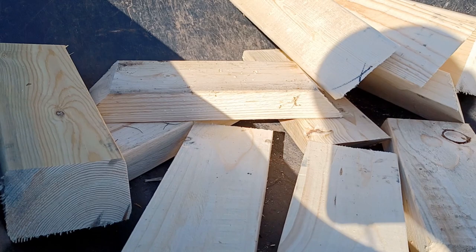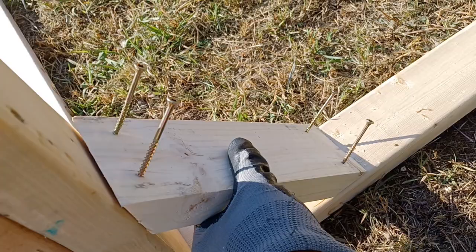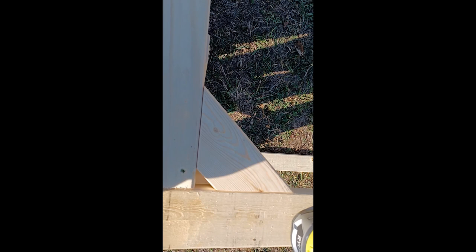I've just cut a bunch of one-foot-long two-by-fours with 45-degree angles at the end and I'm putting screws at the end of them and putting them up like this so I can give some good angle bracing for extra stability and support. Now that I've got these side brackets on, I'm doing these little top brackets a bit smaller so that they don't take up as much interior square footage space.